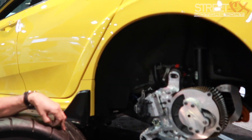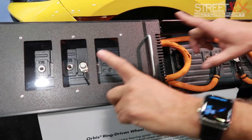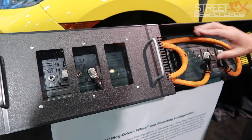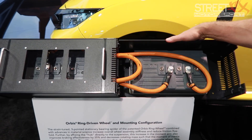There's a plug-in to the CANbus and the software is already built in, so you just route the accessory wiring harness to the CANbus and it's integrated through the throttle. The motor control module talks to the factory ECU — you don't have to retune your factory ECU at all. As far as the car is concerned, it's still two-wheel drive; it has no idea there's extra power at the back. The motor controllers each control the speed and regen of their respective motor, acting as electronic limited slip differentials — no mechanical LSD needed.